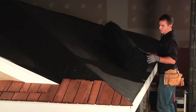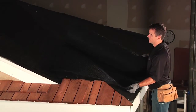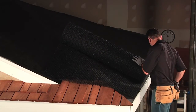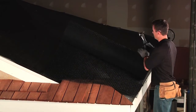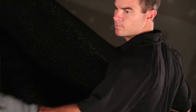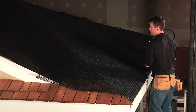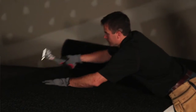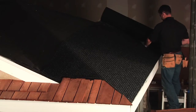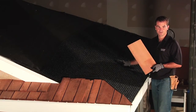Let's continue with the installation of Cedar Breather in a shingle application. All you need is this product — a lightweight roll — a blade, and a hammer tacker or a roofing nail. A helpful installation tip: install one course at a time. Over top of that course, start installing the Cedar Shingles and work your way up the roof. You don't want to walk on top of the Cedar Breather; you want to walk on top of the Cedar Shingles.